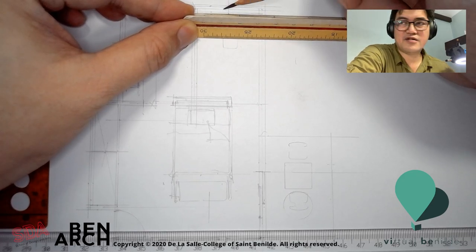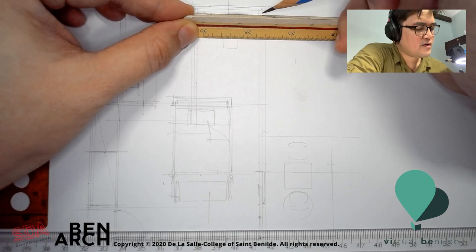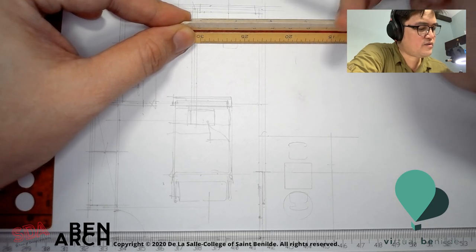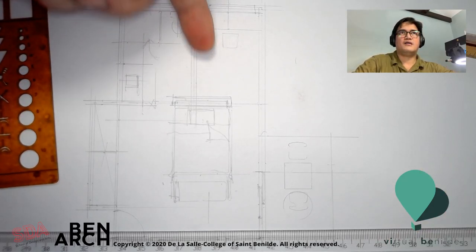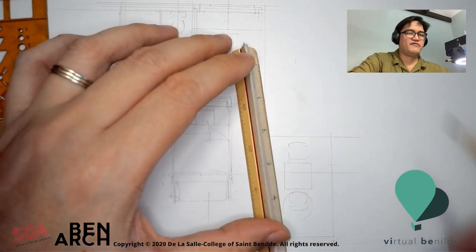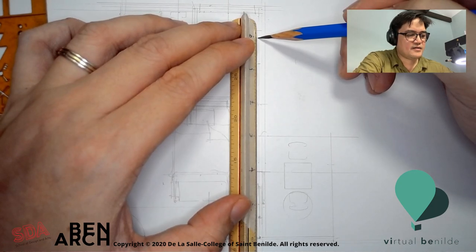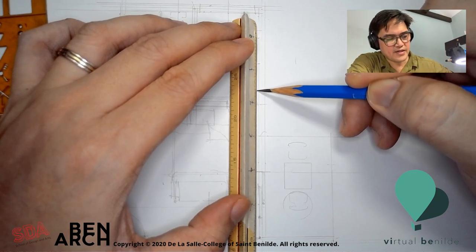I want to fully use this space — I want a wide window here because I want light coming in. I also need cross ventilation, because not all rooms should always be air-conditioned. Natural light and natural cross ventilation should always be present. I'm going to use 1.6 meter windows — 0.8 meter modules. So the wall is going to be here, this is the window — be mindful of where these things are. I want that to be my window over here. Another window here, because I'd like some light coming in also, other than the glass panel doors. During the daytime you can still have this area lit.